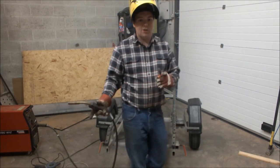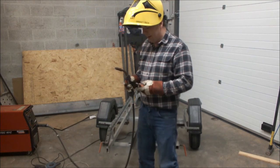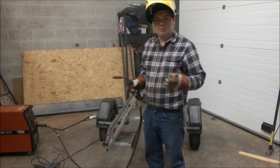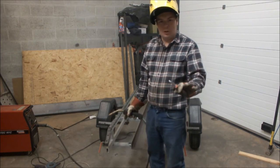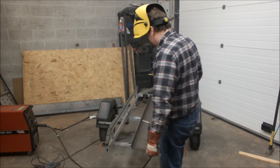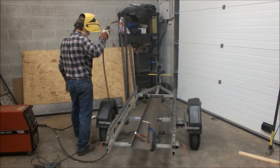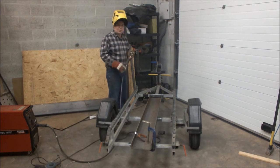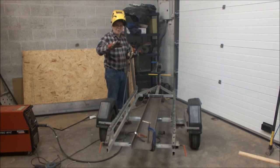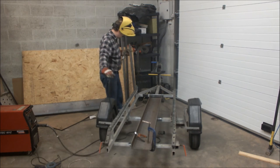If you're new to welding, there's actually another video on the channel - an introduction to welding. We're going to be MIG welding this. All the details and little ins and outs are on the welding video, so I'm not going to dwell on it too much now. What I'm going to do first is put a tack in all four corners. The purpose of that is to stop the whole thing moving around as I'm welding, because the heat will actually pull the job left and right. So the first tack is going to be in this corner.